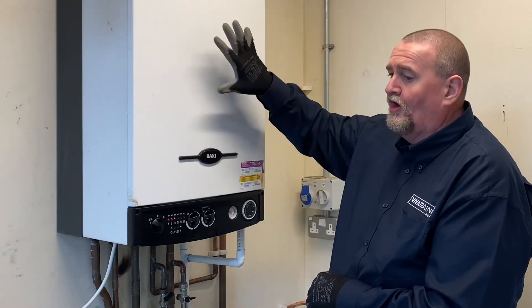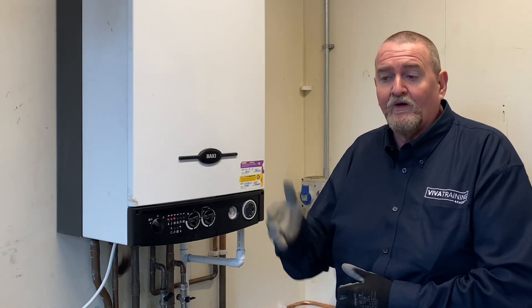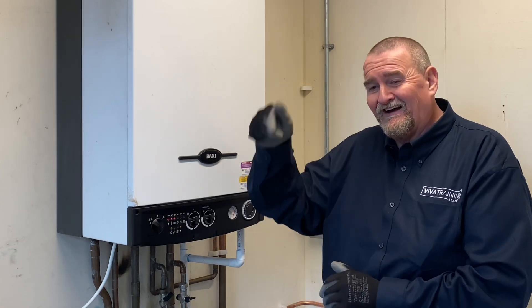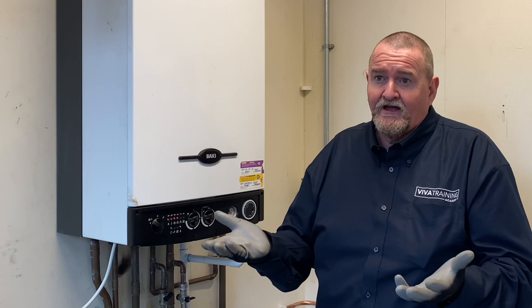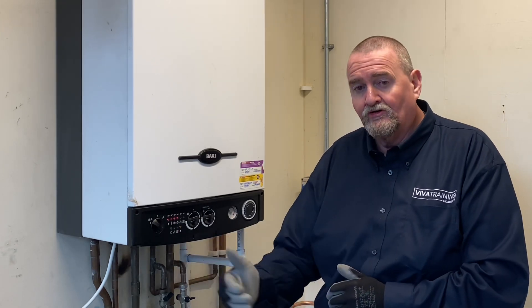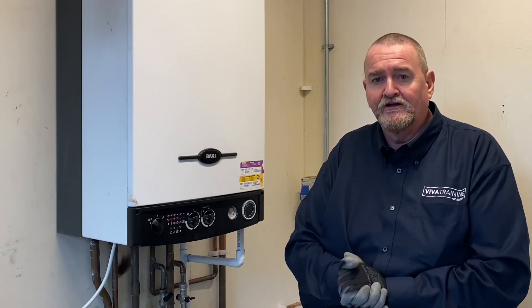What preheat wants to do is get the core temperature of that boiler up to around 80 degrees, so that when it drops water into the plate heat exchanger and we turn the tap on, that water is already warm. One of the issues with combis is that, especially in winter, the water coming into properties is colder, so it takes a little longer to get water coming through the taps at working temperature.